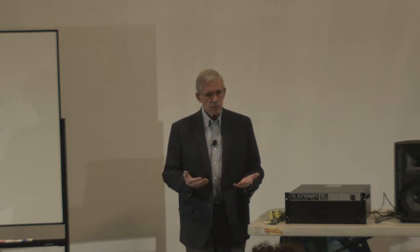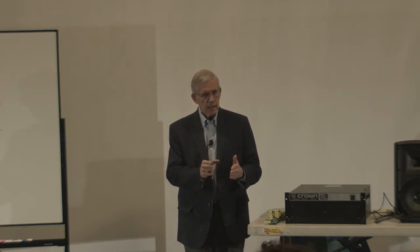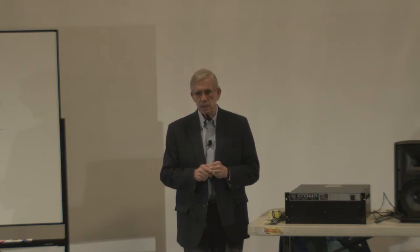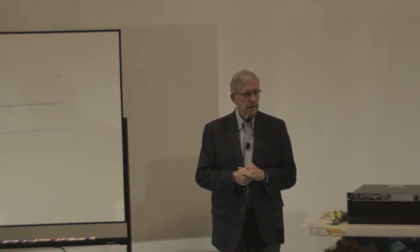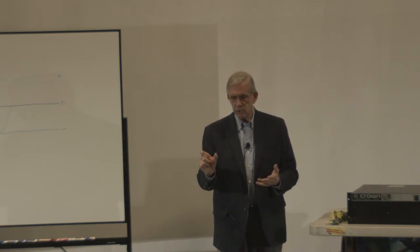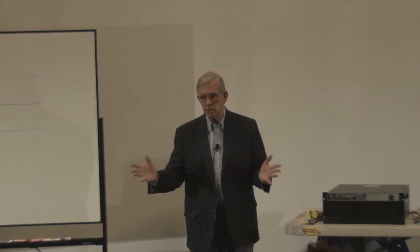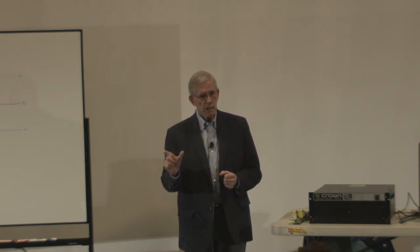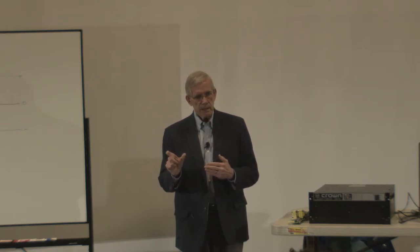The way a Class D works is that they convert the signal from analog into digital, and then they send the digital down to turn the output transistors on and off at a very high rate of speed. It's like 250,000 times a second. It's a very, very high rate. Digital is just ones and zeros. It's either on or off. So pulse width is what determines the modulation. The audio comes in and creates different widths of pulses, and that's what determines the audio.